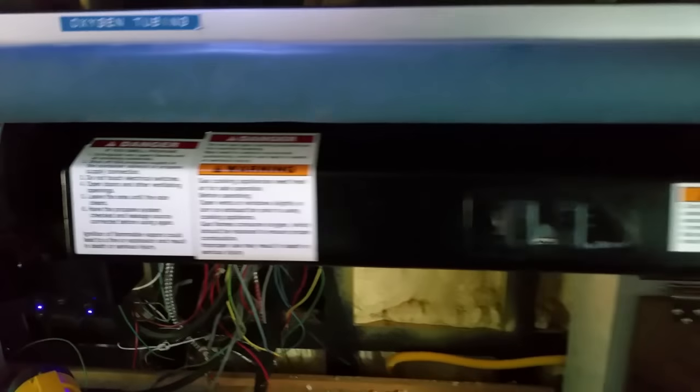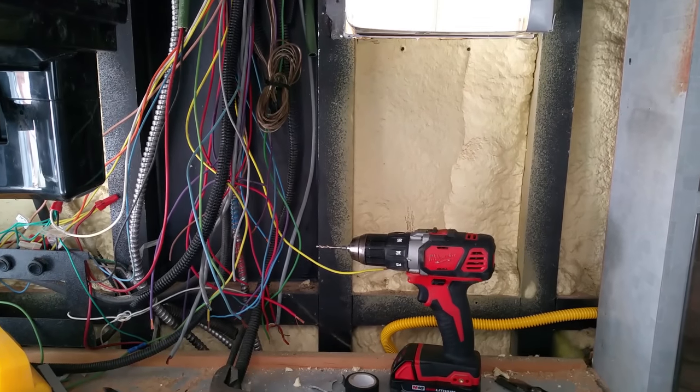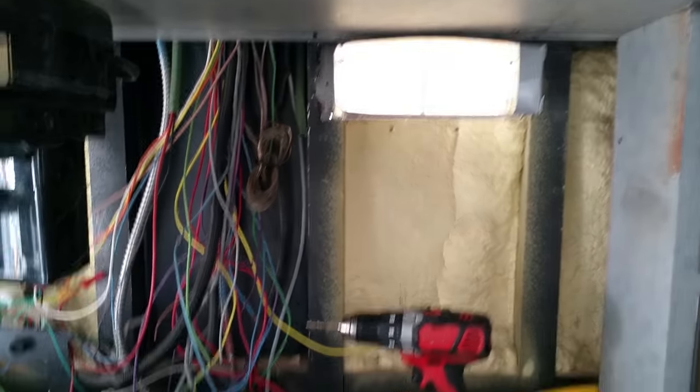The hole is cut. Now I just have to lay out the ductwork for the range hood and get it installed. I've temporarily installed the range hood vent - the hole is cut and the outside plastic vent is just temporarily placed, not screwed in yet. I've marked with a magic marker the back of the range hood and where the vent is so I can fabricate an aluminum channel to vent it out to the vent cover.